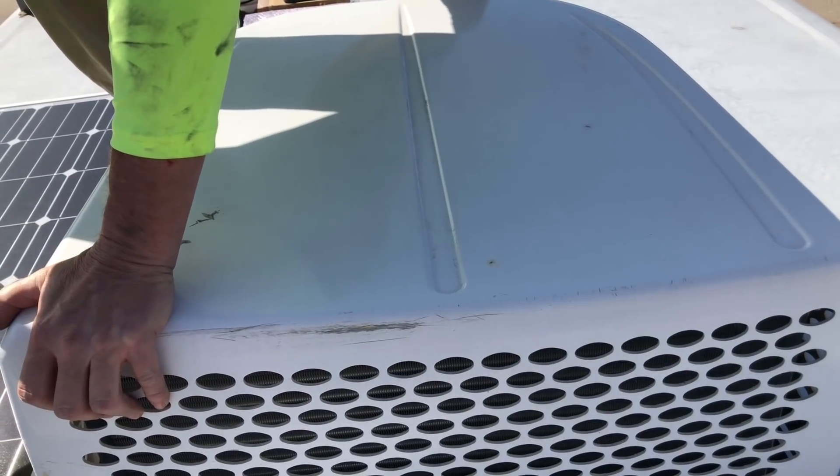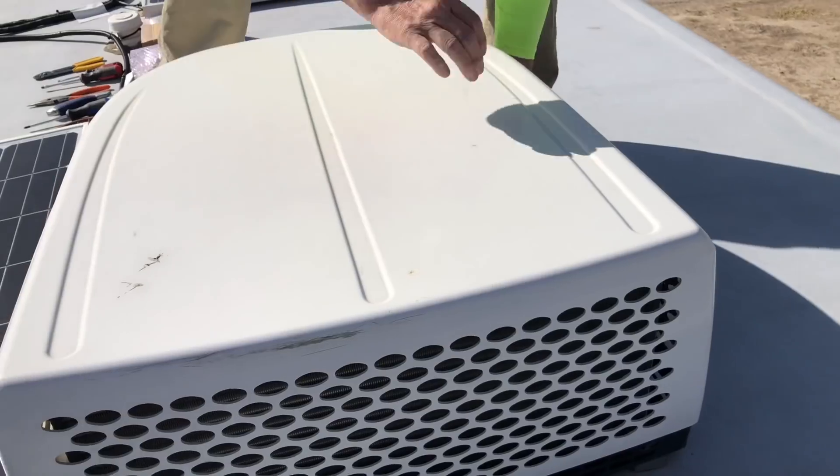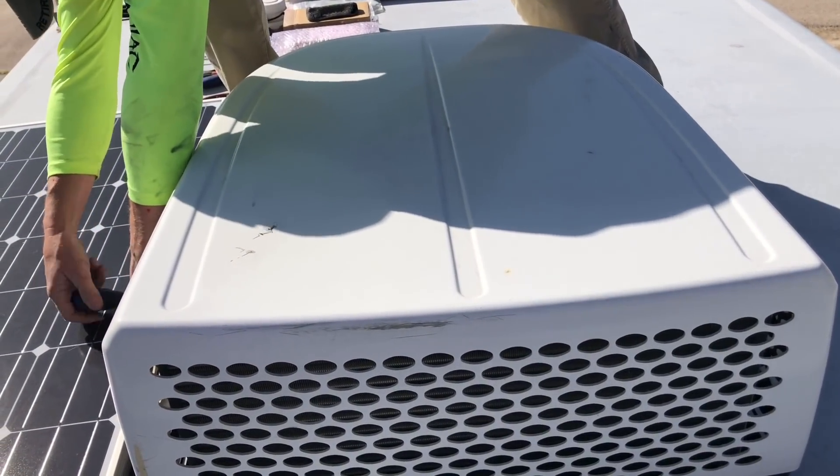And that's it — wiring is complete. Close all open electrical boxes and panels and put the cover back on your AC. Once everything is buttoned up and you've turned your power back on, turn on your AC while connected to shore power. Over the next five times you run your AC, the Easy Start will learn your system. After that, you can run it off shore power, generator power, or your batteries.